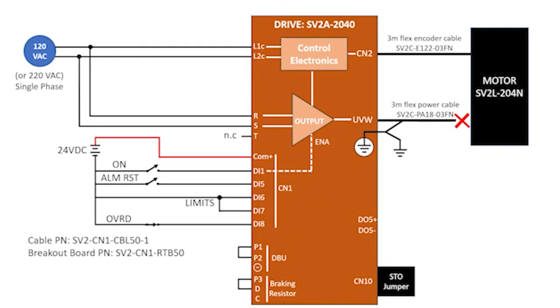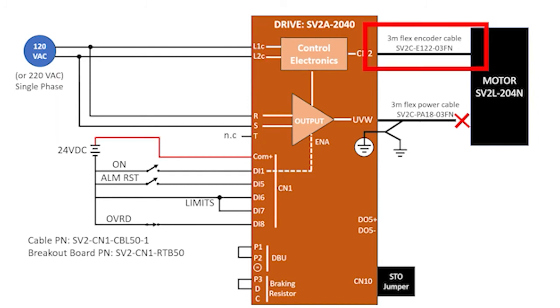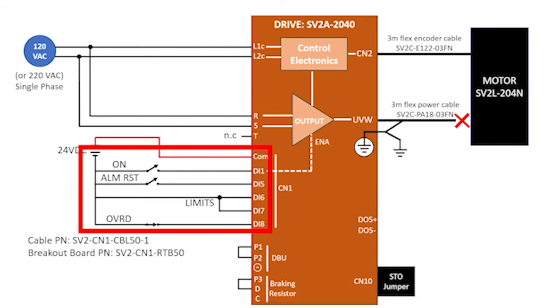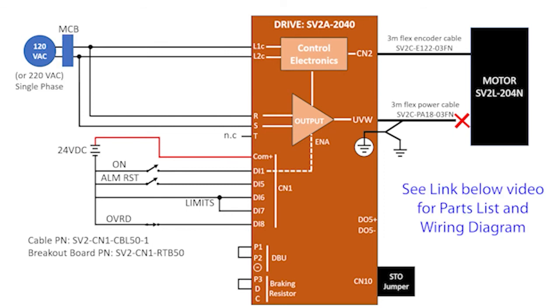And that's it. Now, I did a lot of explaining in this video, but if you think about it, all we did was wire up power to two places, connected the motor's encoder, and almost connected the motor. We're saving that for part 2. We then plugged in all the pre-wired jumpers and added some toggle switches and an external 24-volt supply. I also added a circuit breaker here. Not bad at all. I'll put a link to this diagram and the parts list in the description below this video.